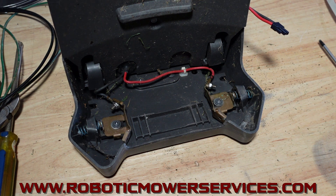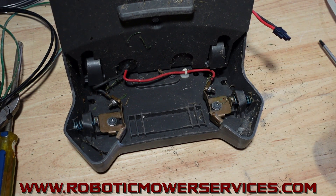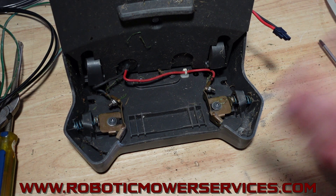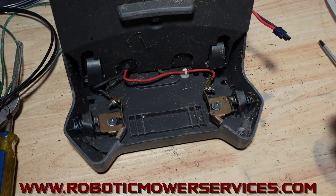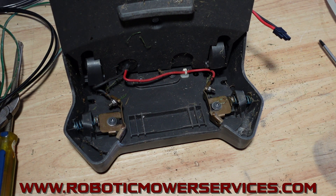That's why you're going to have problems where the mower comes in and backs out and doesn't stay parked, or why it comes in and possibly starts discharging, or just doesn't charge at all — because you have bad connections at these wires. So fix them up, make sure they're good to go. It might not solve all your problems, but it's definitely going to help. In some cases, like this one here, it's going to solve the problem. This isn't one we rigged up to show you — this is actually off our 435X that mows here out back.